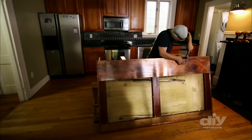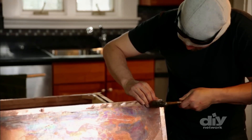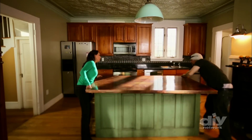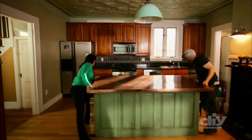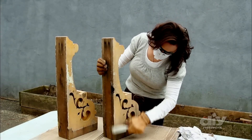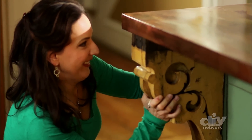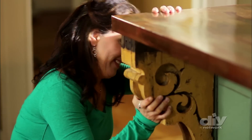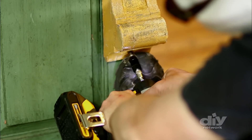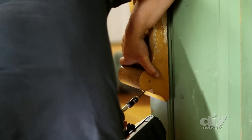A 12-inch wide sheet of copper is nailed to the underside of the countertop, just where it overhangs the seating area. Then the countertop is attached to the island face using metal brackets. Now it's time to add the corbels — they're cleaned and shellacked to preserve the original look. Finally, they're placed beneath the overhang on either side and secured with discreetly placed wood screws right into the door panels and copper.